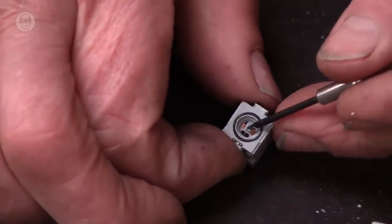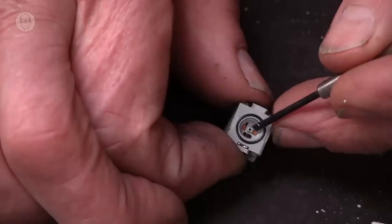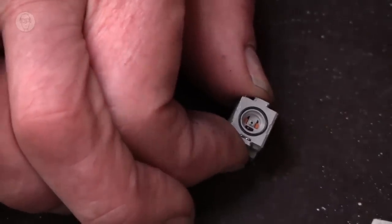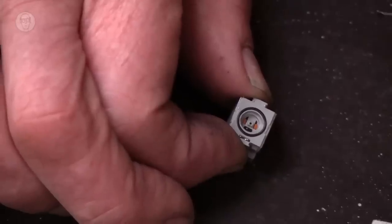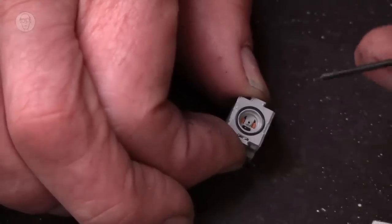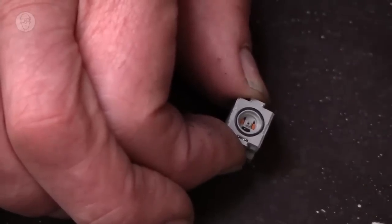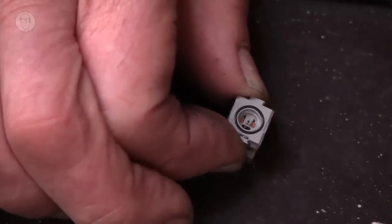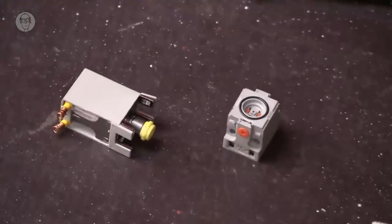These are the tiny little air holes that the air goes through and feeds into the end of the spool. So the solenoid doesn't have to be very powerful just to open these little holes, and it's really using the power of the compressed air to move the main spool to open the different pathways through the valve. Air assisted, I think it's called.